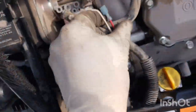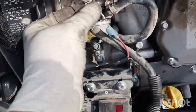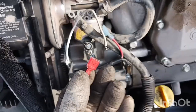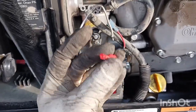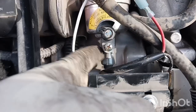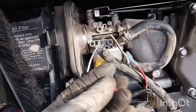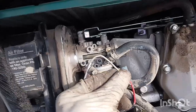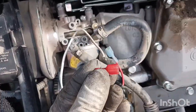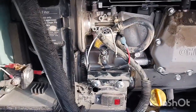What I'm going to do now is cut the old connector off and put a proper one there. This small piece was connected to this wire. I think they may have changed that little fuel pressure sensor and when they did, they cut the original wire connection and put this type of push-on connector. The problem with this type of connection is that over time, with all the vibration these generators make, the connector breaks or comes out of position.